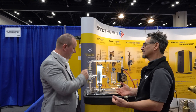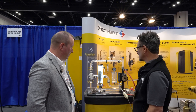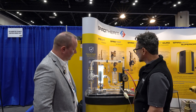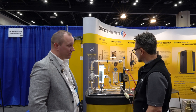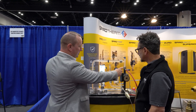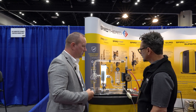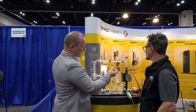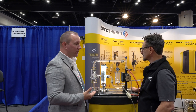I love the simplicity of this. I'll flip the valve so we can see this. So now we just installed our Spirotherm — the Spirovent. What's happening is the air bubbles are coming out, and you can visually see in the piping on top that the water is moving faster and faster because there's less pump cavitation. By doing that we make it more efficient — that's really the end game. Notice this bubble up here: as we take air bubbles out of the system, it becomes almost an absorptive state where we're starving the system of oxygen. You get these little bubbles that peck away, and eventually there will be no more high-point free air bubbles in the system.